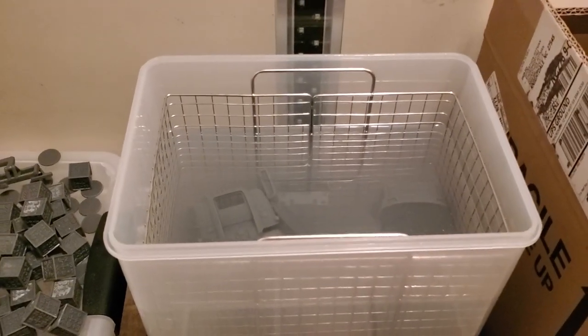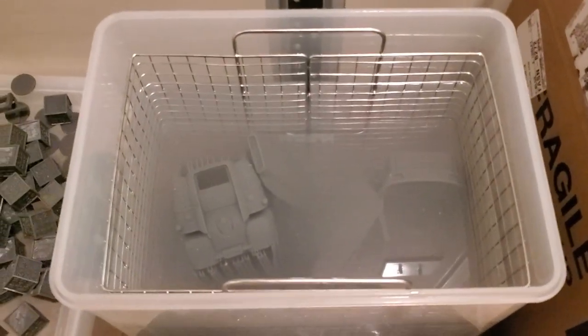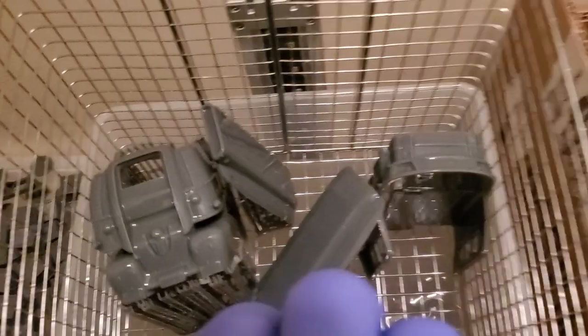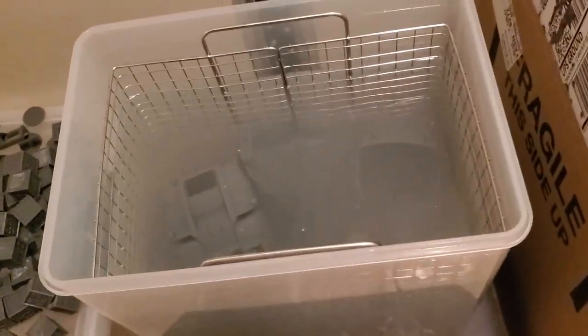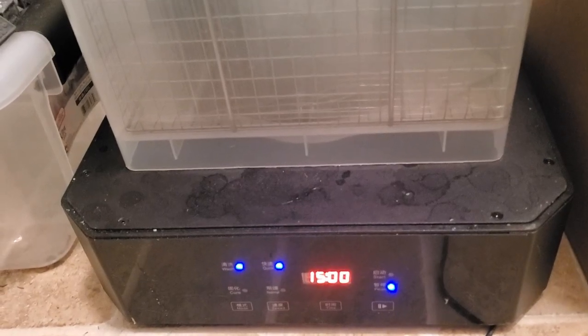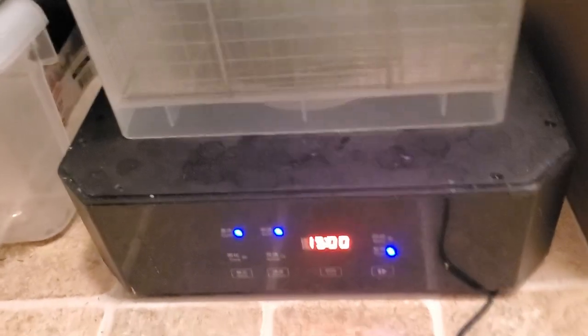We are back and we're about to do some cleaning, post-processing, on our bus. As you can see the whole thing's printed — got it in this little chicken fryer cage in my Wash & Cure station. I have a Creality UW-02 Wash & Cure. It's got a spinner inside that bucket with a magnet and a corresponding spinning magnet in the base of this machine.